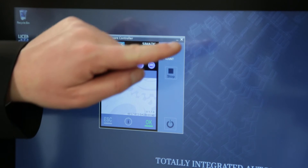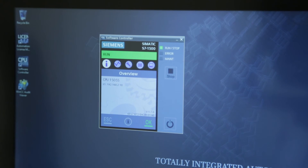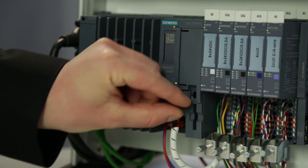I would like to show you how to manipulate the controller and access the controls directly. On the one hand, we have a Windows-side application, which we can see here in this display. The display is the same as with the S7-1500 and offers the same functionality — you can configure the IP address, assign PROFINET names, and also have access to diagnostics and alarm functions and much more. On the other hand, you have a run-stop switch integrated directly in the hardware of the open controller, with which you can stop the CPU and return it back to run. Another interesting feature is the integrated web server, which is ready for use without the need for any additional engineering and allows remote access to the controller.